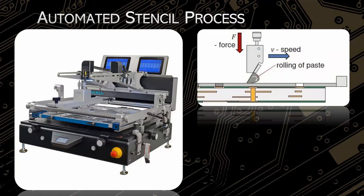Shane, back in the early days, you had to do this, right? Yeah, for the first probably 12 years we used the manual solder paste approach. We were all taught how to do it the proper way. One thing I'd like to add is that at that time we didn't place components smaller than 0603s, and that was one of the reasons we got away with using that more manual approach for so long. The majority of boards today go down to at least 0402s, if not 0201s, 01005s, or micro BGAs. We'd sell a little and then go back and do whatever we could in the back.